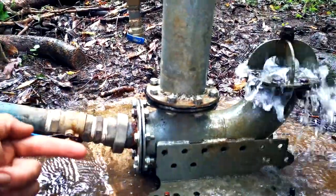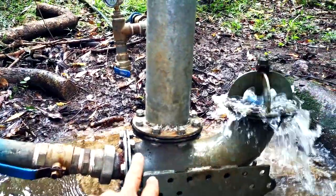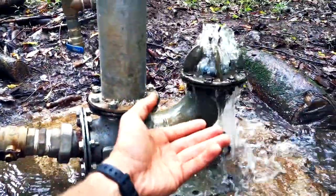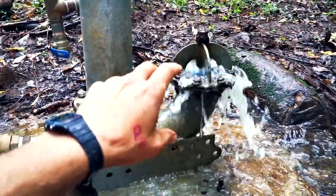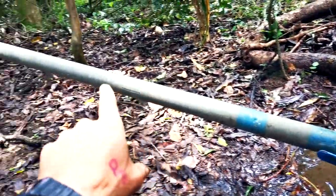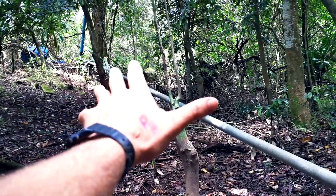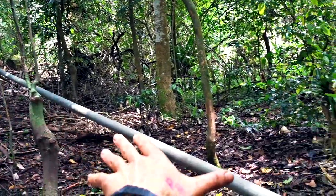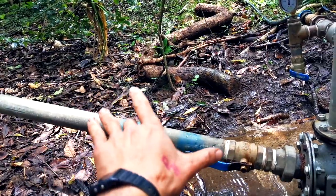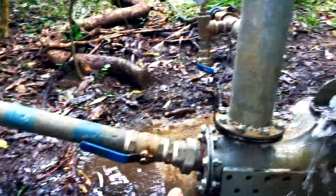The basic physics of a ram pump: you have your drive pipe which comes in here. We've gone from a 50 mil drive pipe into a 4-inch system, and the reason for doing that is just to slow the velocity of the water down before it exits. The larger the volume of water that exits at a time, the greater the drive pressure generated will be. We use steel pipe going up our drive pipe which has been stabilized by two towers. Steel is because it's inflexible — when that hammer runs back up the pipe it's moving at about a thousand to eleven hundred meters a second. If you've got PVC, you get this bulging when that hammer hits and your system isn't as efficient. So I've gone for a full steel system.